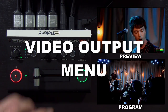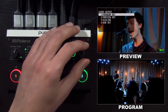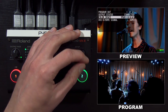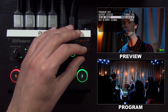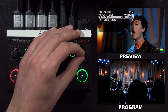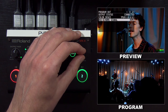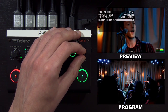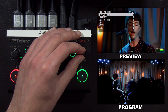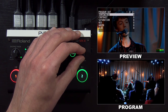You can also make adjustments to the video outputs by going into the separate video output menu. Looking at program output, you have the output status. For troubleshooting, you can adjust the color space if the colors appear off or if there's a tint on the screen. For compatibility, you may need to in rare instances change the signal type to DVI-D. You also have the same brightness, contrast, saturation, and color processing as you do with the input.